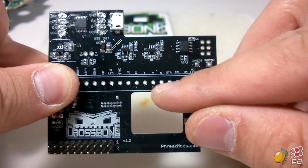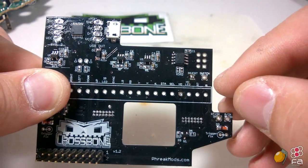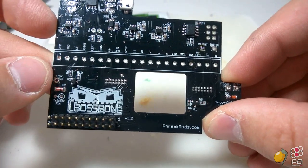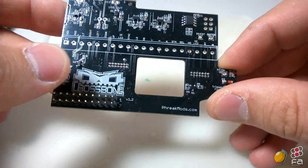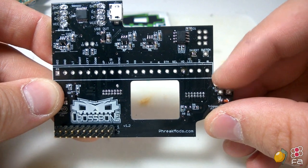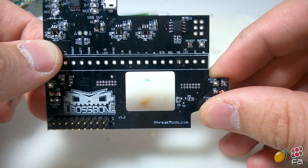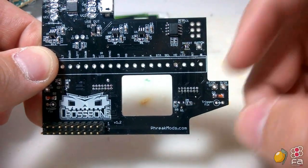So what you do is you wire whatever button you choose up to this switch right there, and when you plug it in, you hold that button down for whatever you decide. If you want the X1, or the Xbox One pad, to be the default, leave it as is. If you want the PS360 Plus to be the default, you solder that jumper there and just plug it in. That way, if this is soldered and you plug it into the console, it will default to the PS360 Plus. If you want to use your Xbox One and you have this soldered, you'd have to hold whatever button down you choose.